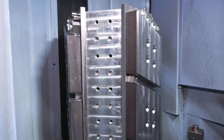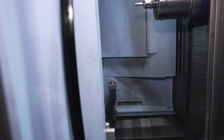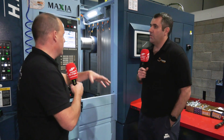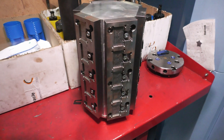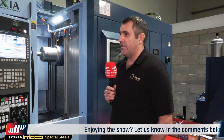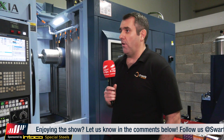Here's the question I opened the show with — why have you gone down this path rather than buying a tombstone from a supplier and equipping it with zero-point clamping or similar? There are two reasons. One is those systems are quite expensive, and when you're trying to fill 15 pallets it becomes a mega cost. Two, if you design your own fixturing you can maximise the capacity per pallet. With standard tombs at four faces with two vices, we'd have got eight parts on. This way we're getting 12 parts on — that's giving us an extra hour per tomb of run time.